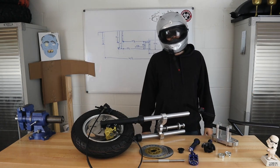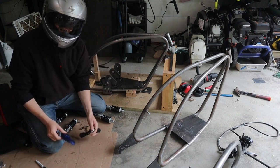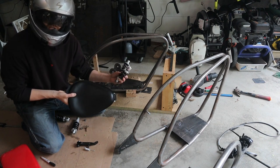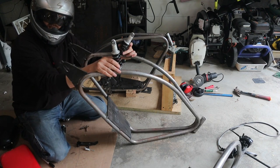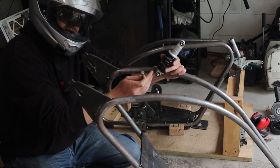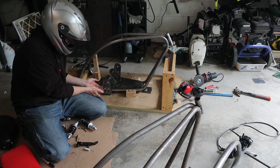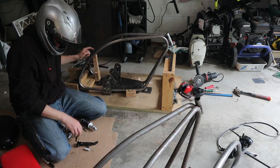I bypassed a couple of things — didn't mention the jack shaft chain, sprocket, keepers, foot pegs, or kickstand. Both of those are going to need a little part welded on, so we'll come back to those when putting on finishing touches. It's time to get this on the minibike and have a roller. Having a roller would let me get comfortable, find a position for the foot pegs and kickstand. But there's one big problem: I need a seat. For this particular build I'm going with a springer seat — small, wide, giving a little bit of suspension. I have a few different springs to choose from to raise or lower the seat. I need to put a couple of mounts using a high grade steel bolt coming up 10 inches high, adding three quarters of an inch for the four bearing support, giving 10 and three quarter inches to rest the bolts on.